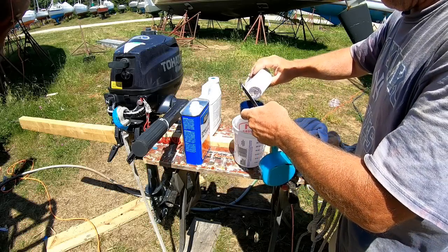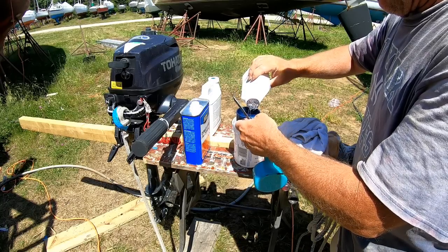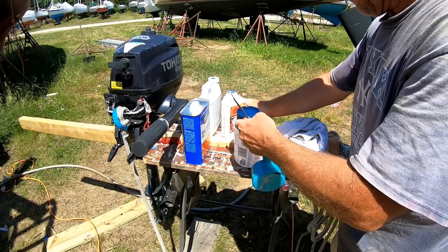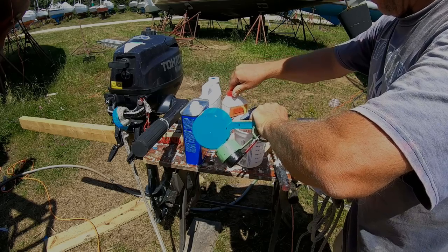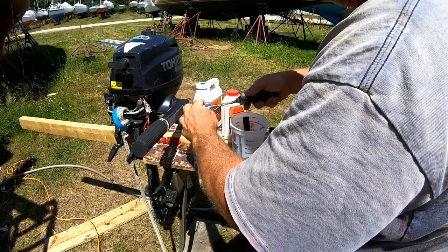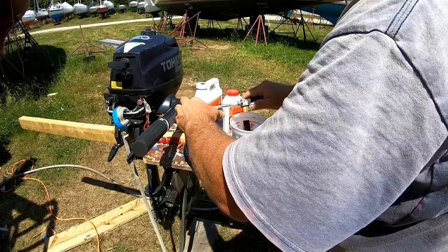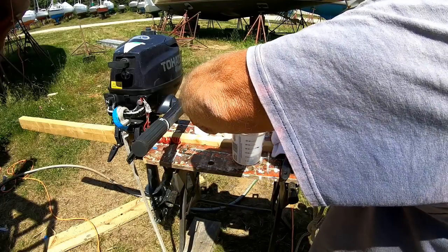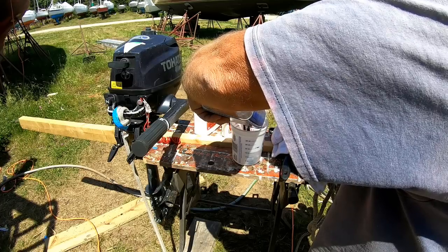So I'm going to mix it up this time, pardon the pun. Before I apply varnish, I'm going to start off with some penetrating epoxy. And I've decided to use the mast epoxy, which is a very thin epoxy which is made to penetrate deeply into wood. And I'm going to give it even more penetrating power by adding about another 50% in volume of denatured alcohol to the mixed epoxy. And that thins it down pretty much to the same viscosity as water.